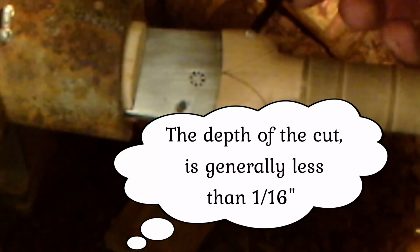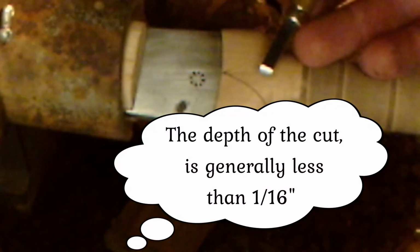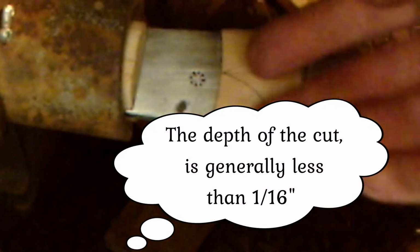Relief carving, we're going to essentially remove the background. So all this wood right in here in between these two haunches is now scrap. So we're going to remove the background, and that's going to reveal the haunches. Basically that's what you're doing when you're carving. When it comes to the knot work, you're shaping and removing background at the same time, which of course I will demonstrate. But to get these haunches to pop now, as I said, we're going to butt into this cut line with our chisel and then remove this background slowly.